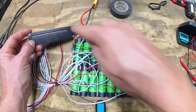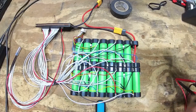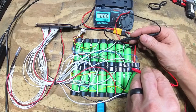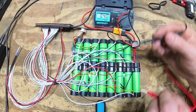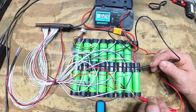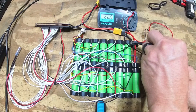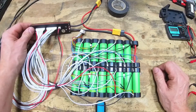Okay, there we go — looks like all the cells have officially balanced, the lights have gone off. They should read 4.2V per cell — reading 4.1V, but within tolerances of this voltmeter. Overall pack reading 62.9V — again within tolerances of this voltmeter. Beautiful, it works.